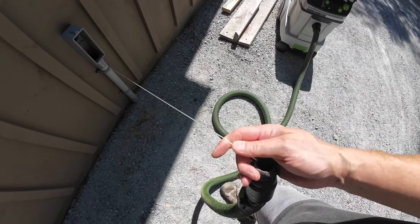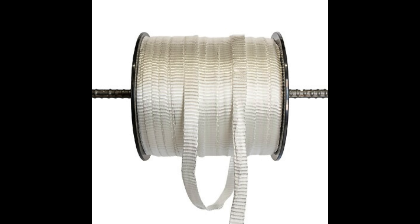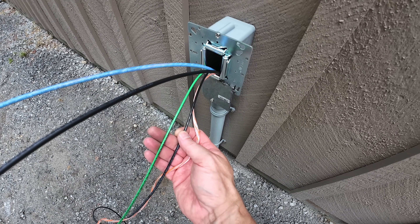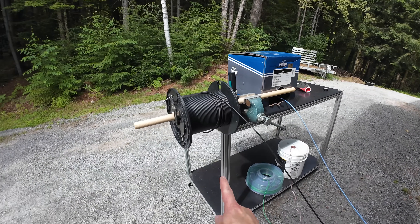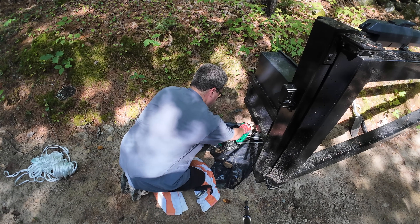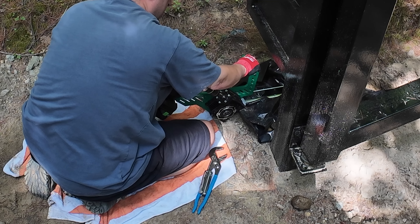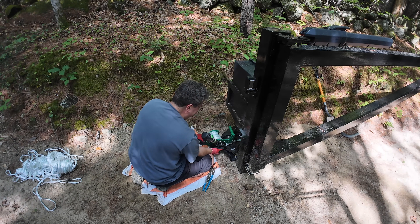This masonry twine is fine for the initial pull, but you're not going to want to pull it for any kind of serious distance. I ended up using mule tape — a much thicker version of string that can handle a much harder pull. For my cable pulling setup, I'm feeding into this conduit a piece of Cat ethernet network cable, a piece of two-strand fiber optic cable, and additionally green and black THHN wires that are 12-gauge copper. With a thousand feet of friction I couldn't do it by hand, so I used a tool called a VersaTugger — essentially an electric fishing line that does all the work. After about 10 minutes, the cable assembly pulled through completely from the workshop to the gate in one single continuous pull.